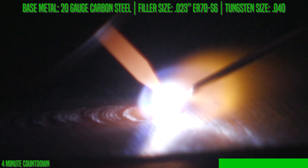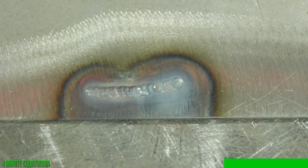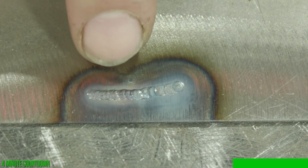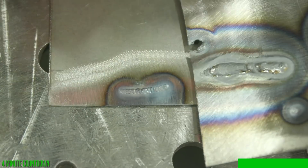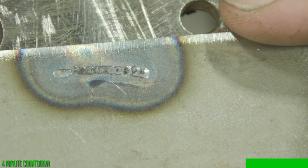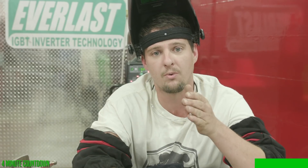If we look at this on the back side when we get done welding, we'll have just a little bit of penetration. You can tell there's a lot of difference here — our puddle is not big, everything is more consistent, and our heat affected zone is a lot smaller. See this one — look how big that was. Just compare that. It's a big difference. Look at the back side — we're good here, we're not overheated. This is what you want to do. So if you're having problems at home blowing through your base metal, definitely correct your filler wire size, and your tungsten size is kind of important too.